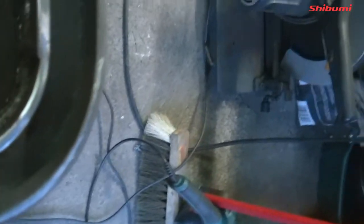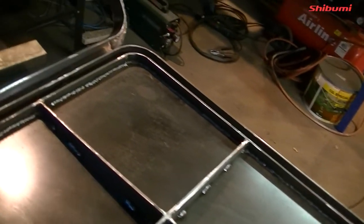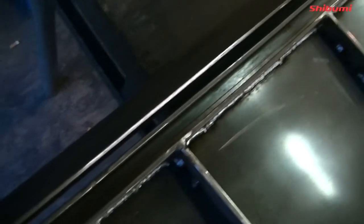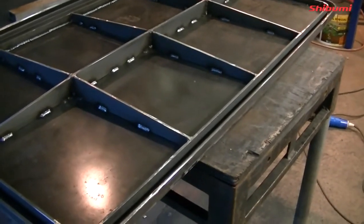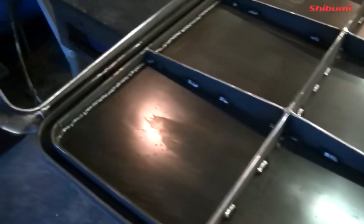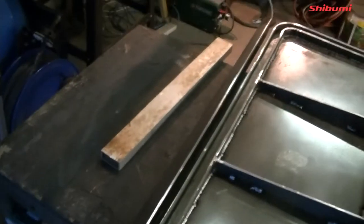The inside seam isn't welded, it doesn't need to be, but the joints are, where I did join them. That's actually a joint there and you can't see it. And the same then on the inside, the inside of the seal channel is welded the whole way around, and it's not welded on the inside there. So what'll go in there, that's exactly 20mm, give or take half a millimeter. And an 8 or 10mm neoprene seal is going to go in there. I have it ordered. Bend it all around, join it at the top, glue it, and stick it in there. So that'll become the seal that'll press against. And there is a slight deflection in the door, maybe 2mm in the center, it just rises up slightly, and that'll all be taken out once the door is clamped shut. So we'll have 3 points there, 1, 2, 3 to lock it, and 3 hinges on this side, which I'll make in the next couple of days.